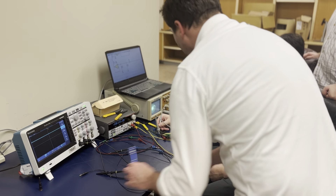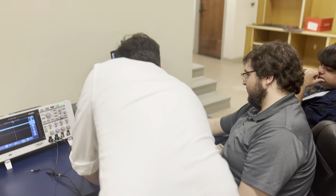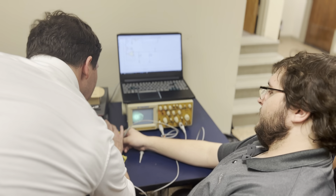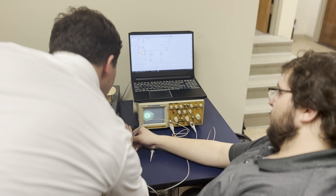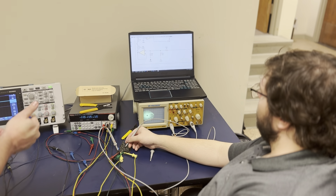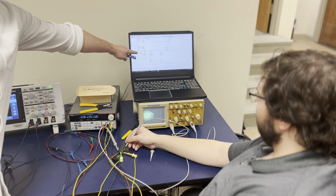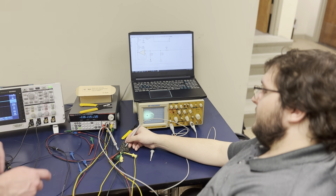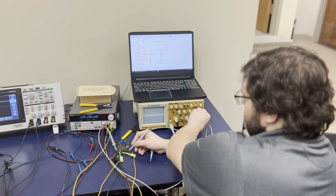I just gotta tweak those resistors. There's a couple of things — whenever you move those, that's hand-fixable. When I move the negative R, you should see the growth change. There you go — eye opening up. This is very close. What's happening is this right here needs a way to be adjusted. It means that the thing coming out of here is not plus or minus one volt — it's something else, something higher. The thing that comes out of here needs to be plus or minus one. If you put low-pass filters on them, that could help.